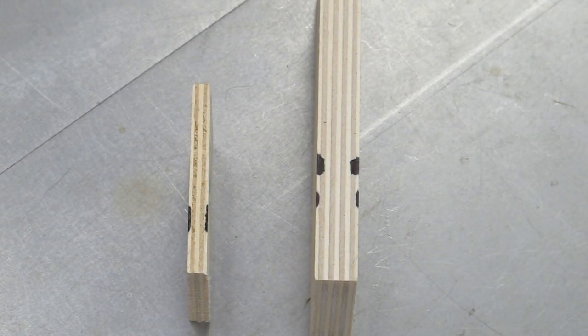It's a lot of work to make all of the plies for a piece of plywood. One possible shortcut — and it might even be a better approach — is that we know Baltic birch is stable. For a quarter inch, you can take off the two outside layers. Or for a half inch, we could take off one or two layers from either side, then laminate the thin wood we've created to either side, put it in the press and clamp it up. That would save a lot of time.